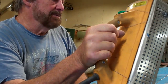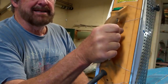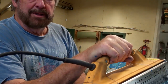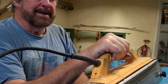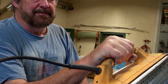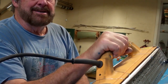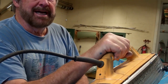I'm using it here for two reasons. One, it's very quick. It's quite aggressive. You would not want to use this stripper on a lap strake boat, any decks that are plywood, or on topside planking or transom planking — because it's very, very difficult to know when enough is enough. And if you go beyond that, you actually burn the wood, and it's very difficult to sand topside planking deeply enough to get through that layer and still have it flat.